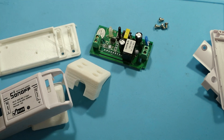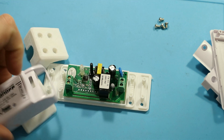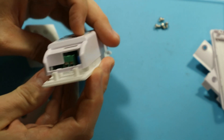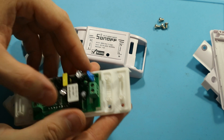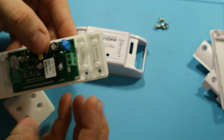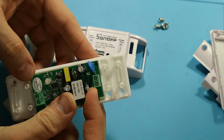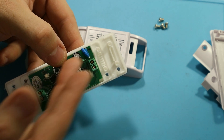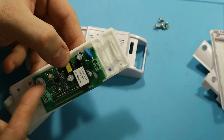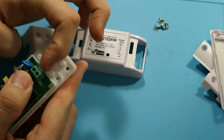One cover for each side. So finally, how do we route the protective ground through all this? If you just look into it, you can see that there's plenty of space to cut your cable in a way that you just let the protective ground pass through and route it somewhere like here. Unless you overload your Sonoff, it won't heat up, so the cable won't melt or anything — it's pretty safe to run it here. And with this enclosure, you also have the space to secure it on both sides.